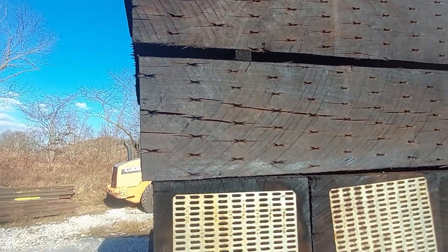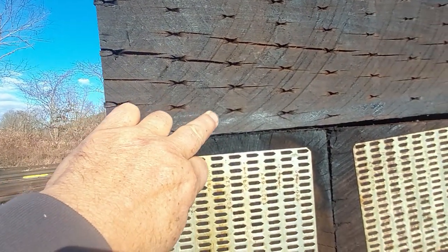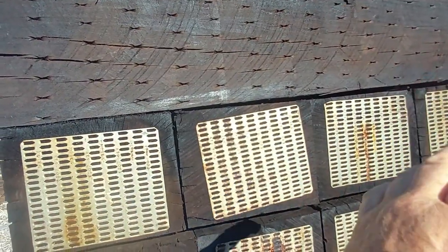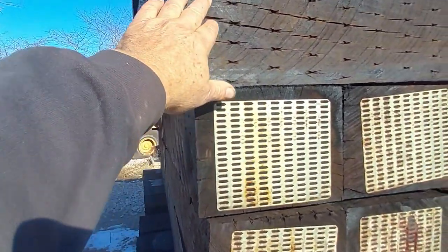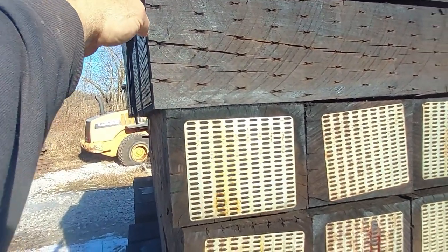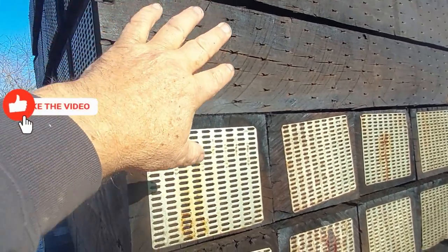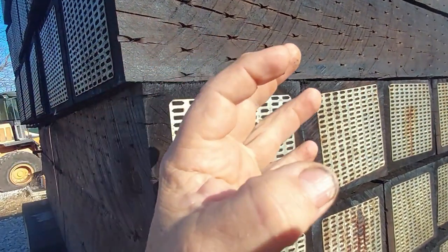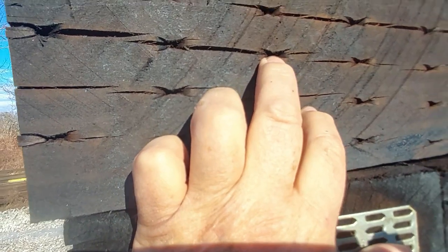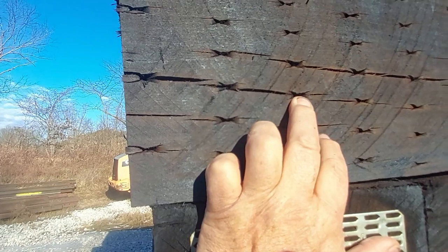Well, here you go. I showed you that picture, that incisor, and this is the marks that they make through here. They run the ties through and then flip them over so that all four edges, surfaces of the tie gets incised. I showed you the one drum over here. On the other side, they have another drum. So those drums come together and press into that. That is probably close to a half, maybe not quite a half inch deep.